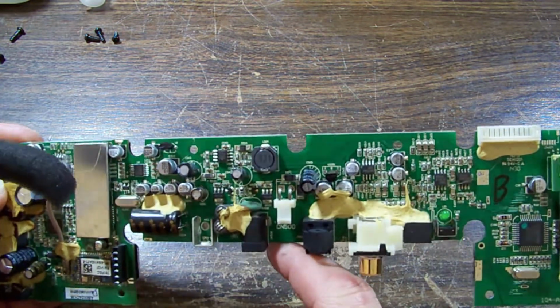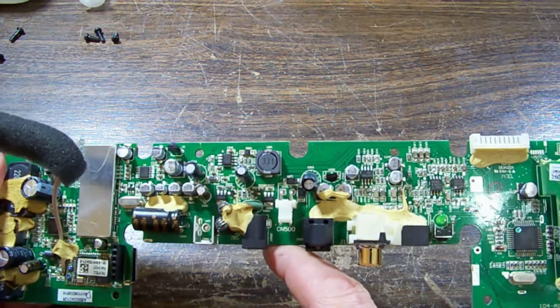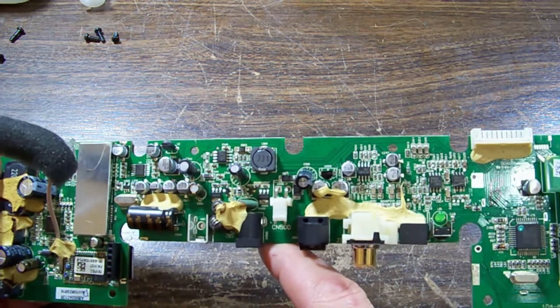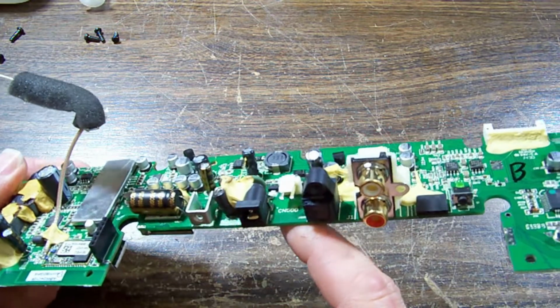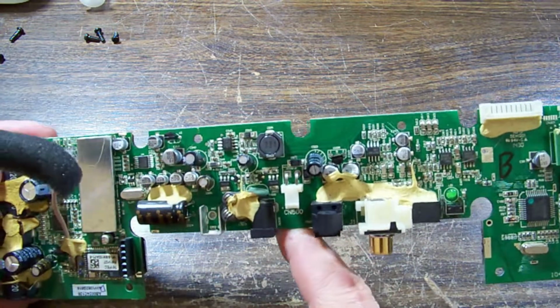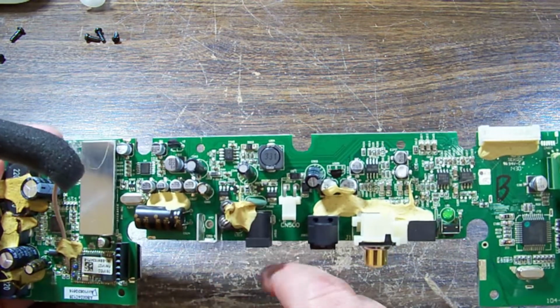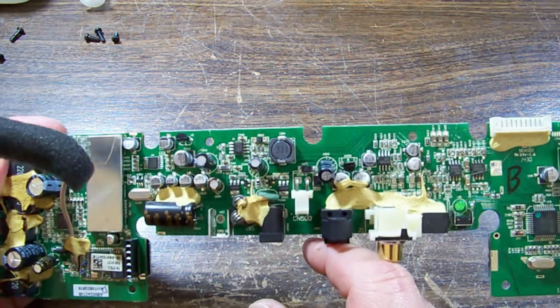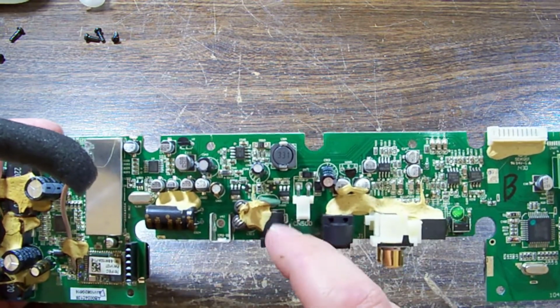Possibly. It's either an inline inductor or it's actually a regulator for a different rail. Quite likely a rig. What's those caps? 10 volt. Yeah, there'd be a rig there. Possibly a couple of linear rigs. Little packages. Okay, I can see it looks like it's got a bit warm just down in this area.